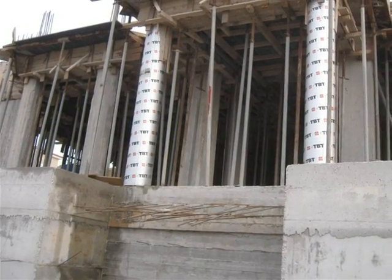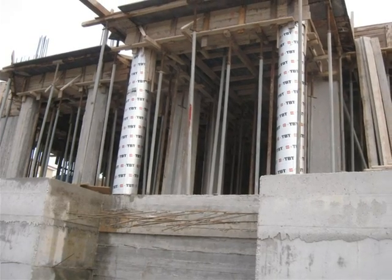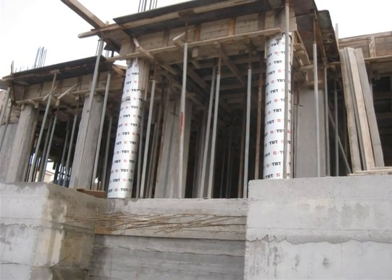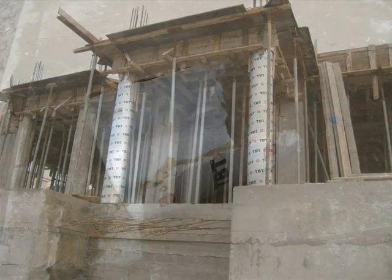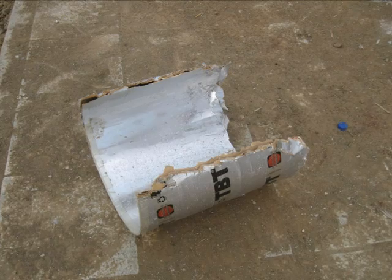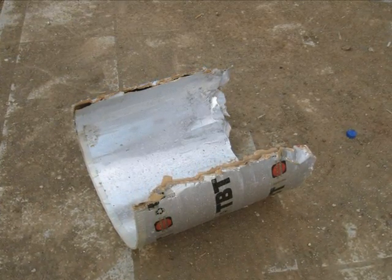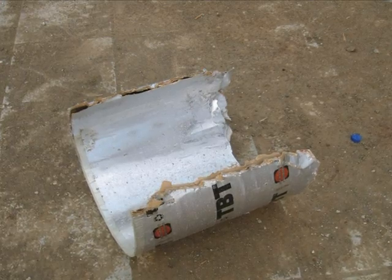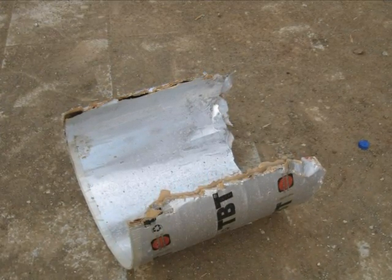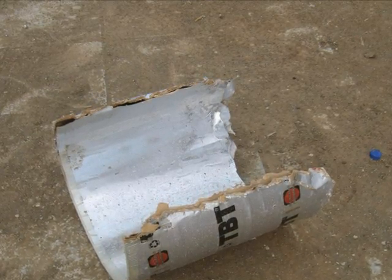On this one you can see some tubes — two tubes on either side of that entrance. Just to see how the concrete is poured in there and how it works, we'll have a look at one cut open. On this slide you can see it's got a sort of aluminiumised foil on the inside, which stops the cardboard from disintegrating, but it's easy to cut at the end to leave you two nice pillars with reinforcement rods right down the centre.